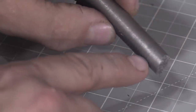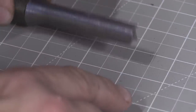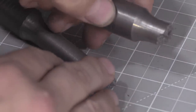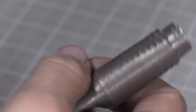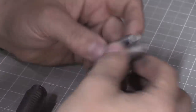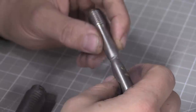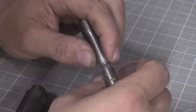And as you can see, because this hasn't necked much, you can see some parallelogram going on, there we go. It hasn't necked much at all. Same with this end, there's not much to see on this end, but it really hasn't changed diameter that much. And that's because this stuff, although it necked, is a lot more malleable, which means it can take a lot more abuse before it ultimately fails. And that's a good thing.